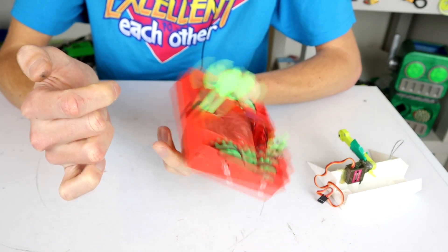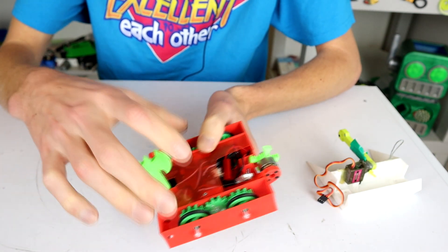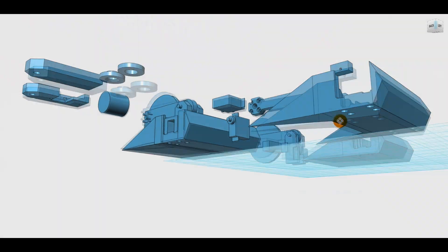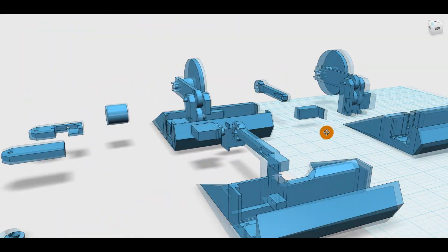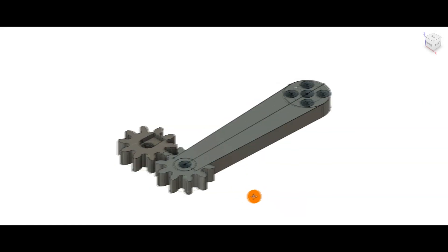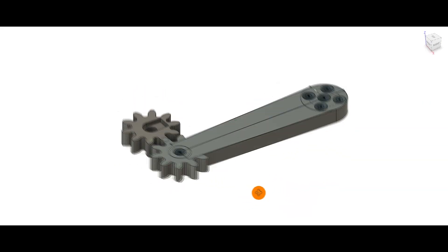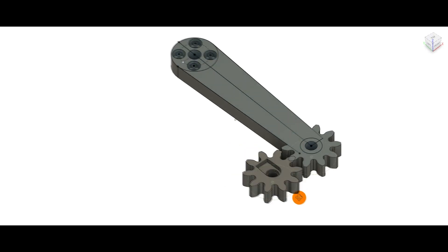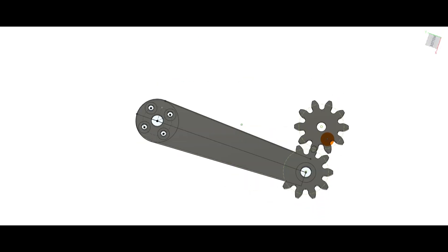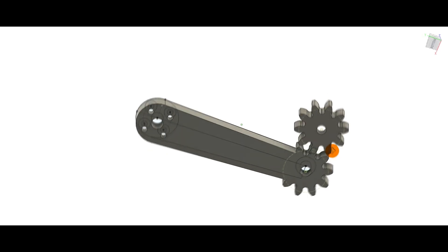The first thing we need to do is get some design work going. I personally use 123D Design to block out most of the shapes and then go over to Fusion 360 to do the gears, motor, mountings, and that kind of stuff. With that done I then normally go ahead and print a prototype — not the full chassis, just a handful of parts. And here's our prototype.